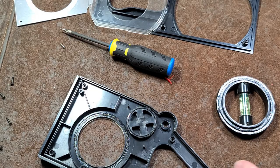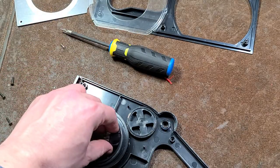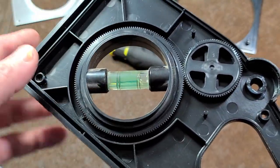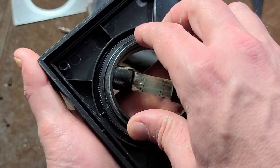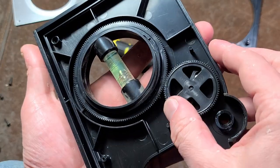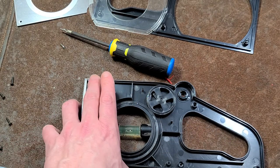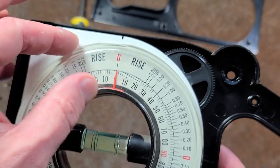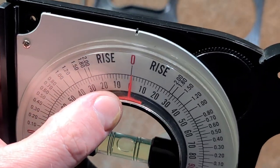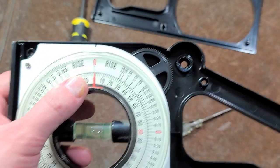The gauge face is like a 1/16-inch plate aluminum. They do have a very thin nylon washer right there, so this actually has quite a few nice build features — I wasn't expecting a thick aluminum plate for the base. Surprisingly enough, the dielectric grease is exactly what's providing the friction. There are no special springs or anything else — just relying on the grease. So if this thing ever gets loose, you can just take it apart, clean it out, put some more dielectric grease in, and that's what provides the cushion and smooth resistance. Under the needle there was a touch of glue to keep it in place, which I did break, but with the plastic cover on there's not enough space for the needle to fall out of its holder — so even if you drop it, the needle won't float around inside.